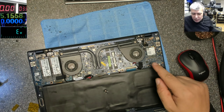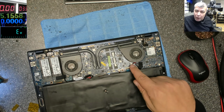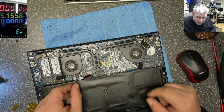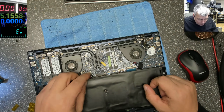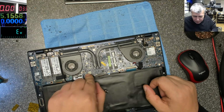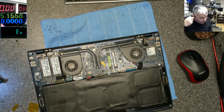Another sign is the BIOS battery is 0 volts, and the BIOS battery, it's a low power track which is going to the Super IO. That's a sign actually even the Super IO is dead. Okay. You plug the battery, the 19 volts power rail is not shorted. It still looks like it's charging, but I don't know.